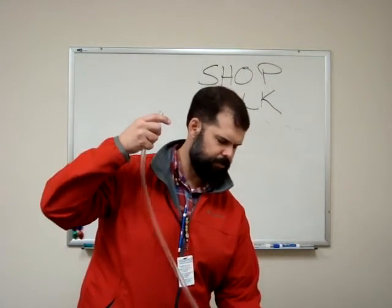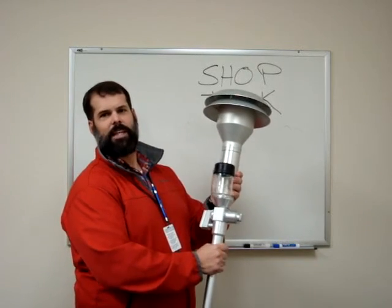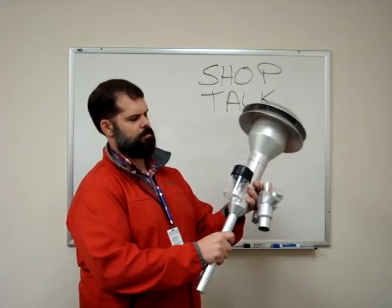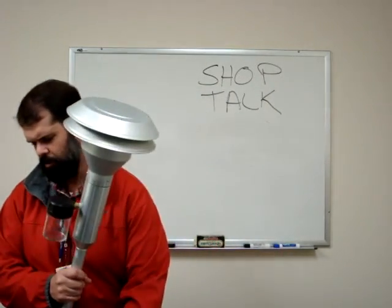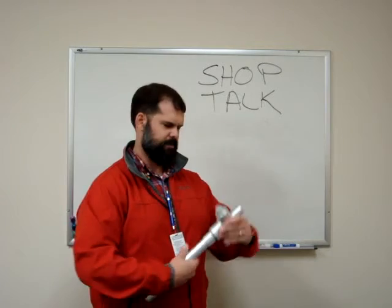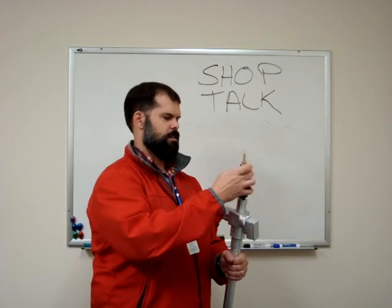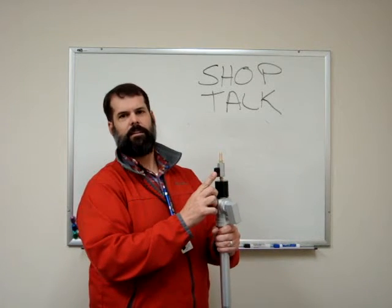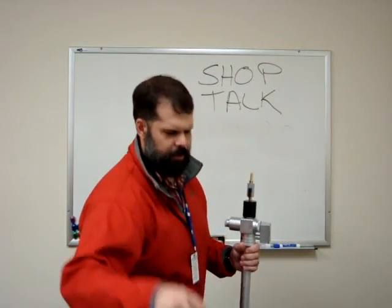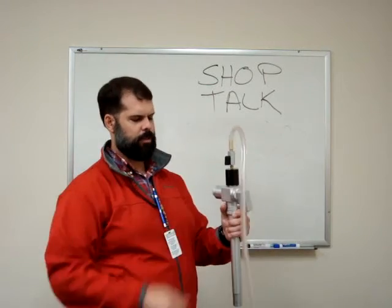With it level, place it on a level surface. Here's your typical BAM 1020 or 1022 setup. If you remove the sharp cut cyclone on top, that's your FRM setup. We'll use the BAM setup today — take off the PM10 selective head and you'll take your flow audit adapter, which has a large port on it. Ensure the flow adapter is open and not turned off, then attach the hose — whether the pump is running or not doesn't matter — and wait.